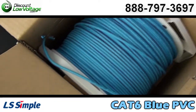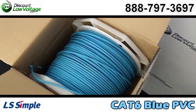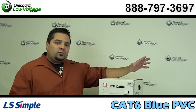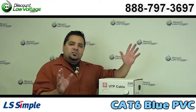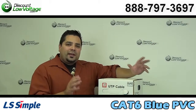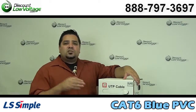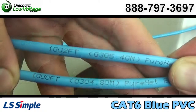This CAT 6 cable is packaged as a thousand foot spool that rotates inside the box for an easy tangle-free pull. Manufacturers offer the reel-in-the-box design because after installation, when you punch down your jacks, kinks will hurt the cable test results when you put it to your certifier. That's another thing they've done to help you pass your certification test, for contractors out there, and to make sure the end user has the best possible speed and test results for their network.